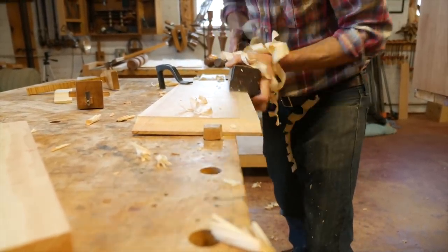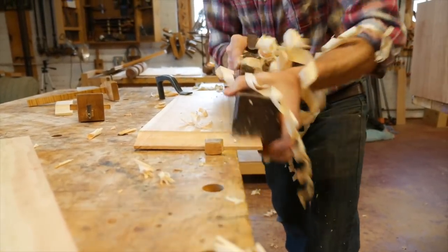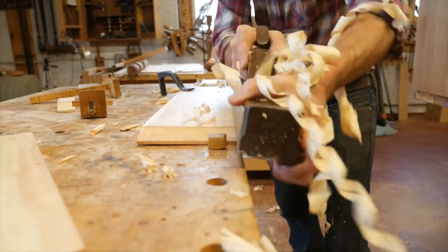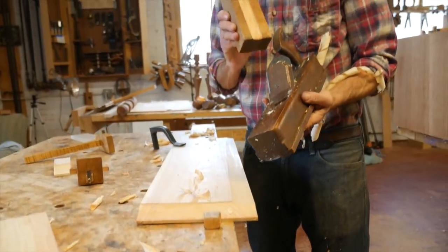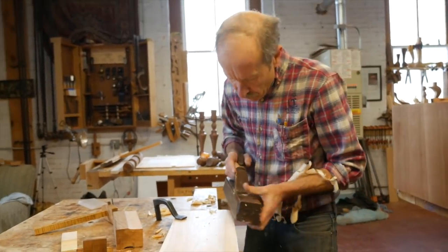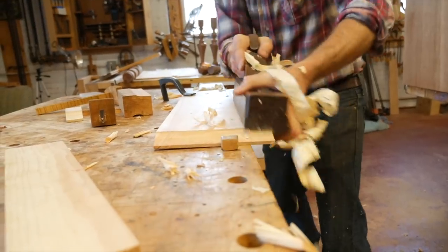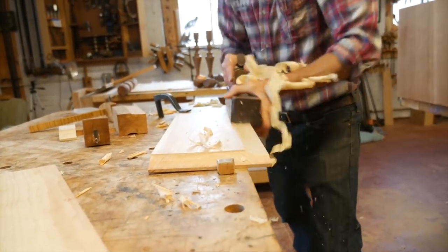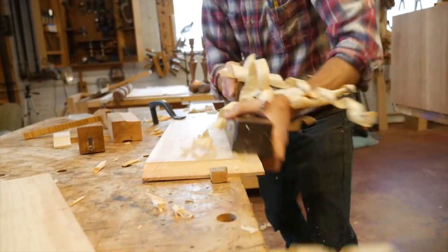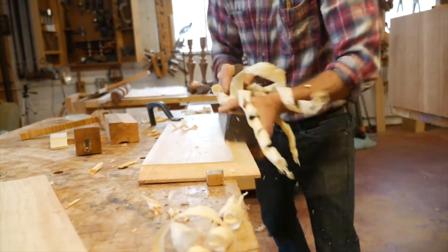It's great because it makes a panel that tapers down to the point where the edges are almost parallel. When you make the field with this plane, it leaves a very nice, clean edge, so the panel has room to expand and contract and it won't open up the gap. It will adjust the width of the panel — I can go to about a two-inch field, and if I'm doing something smaller, I can move the fence over and get a smaller field.